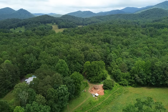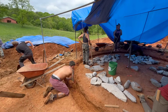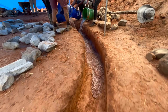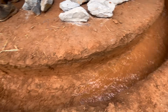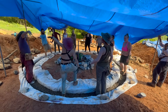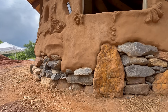Before making cob, we first had to build our foundation. When you build a house with earthen materials, it's important to build strong foundations with adequate drainage and strong roofs with large overhangs to protect the walls. We start our foundation by digging a drainage trench that slopes slightly downhill, and we test our trench by pouring water in at the high side. Once we confirm proper drainage, we lay the landscaping cloth and fill the trench with compacted gravel. Next, we stack our stone foundation, which elevates the cob walls off the ground to keep them dry and also structurally supports the weight of our wall system.